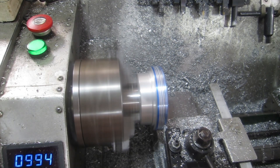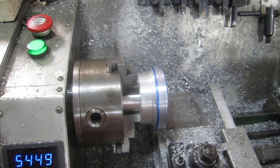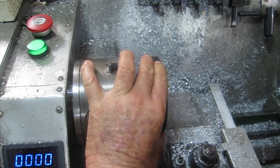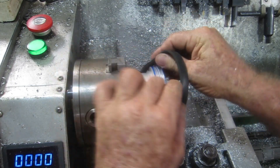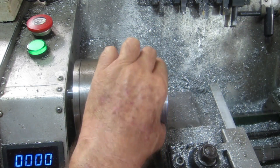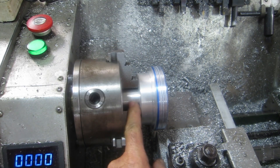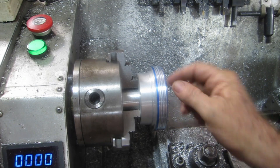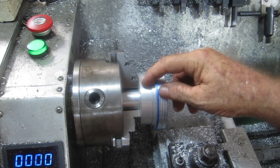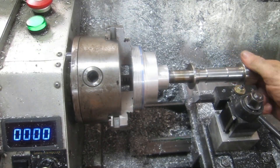I sharpened the tool - the same tool I used last time - and it wasn't so gummy this time; probably a slight difference in alloy too, who knows. That looks pretty good. I might just dress it up with a little bit of sandpaper and that'll be almost done. The only thing left is I partially machined the back of this for the 16mm shaft, but this has to have a bit taken off the front yet and I couldn't reach far enough up inside, so I'll flip it around and do that.